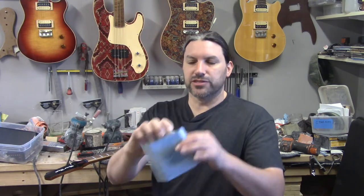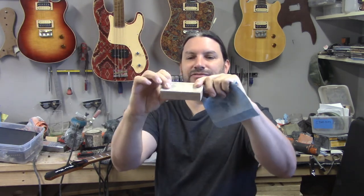Another thing I've been told my whole life — always use some kind of sanding block. This for example is a sanding block made of cork. I think I got this at Rockler. If it gets wet it doesn't really affect it much, and if it does you can sand it back and make it flat again, so it works for wet sanding but also for dry sanding. We also use bits of wood scrap and make those into different custom-sized sanding blocks. The cork has some give to it, while a piece of plywood sanding block has none.